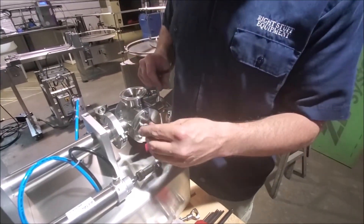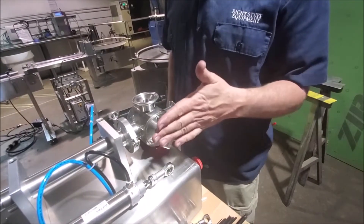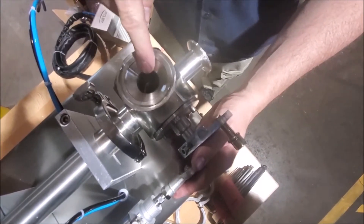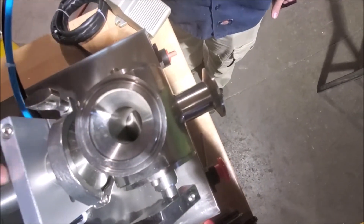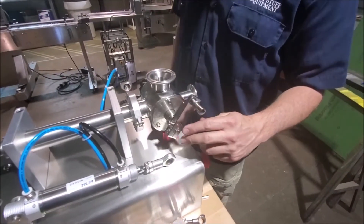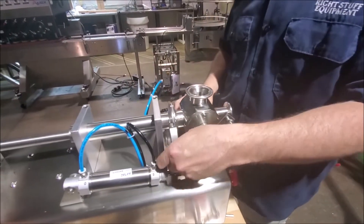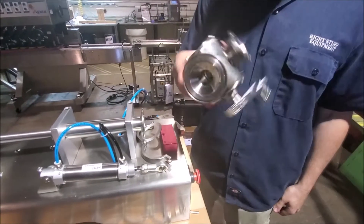I'm a firm believer in putting bolts back where they came from. Again, do not remove this arm — remove the air cylinder from this point here. If we look down at our three-way valve, this would be where we're pulling in product from the hopper into the piston. And then when it's back, you can see it's closed off the top and that opening is coming from the piston out through the nozzle. That's why it's important not to move this arm — if we move this arm, we might not fully open or fully close that valve and it can cause some issues. After that, we can just pop off our three-way valve — tri-clamp fitting and seal.